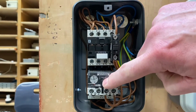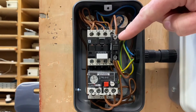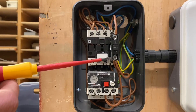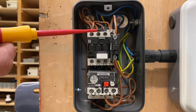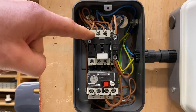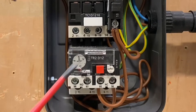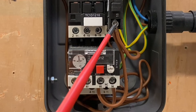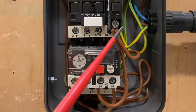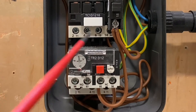I'm taking the red one down here with my stop. We've brought a line through to number 17. The start button — both 17 and 18 are connected in parallel with the retaining contacts, numbers 13 and 14. So we have a permanent live feed here, here and here. Then as previously, we take a conductor from number 18 like on the diagram in the classroom where it went to the stop button. The stop button here is built into the overload relay.